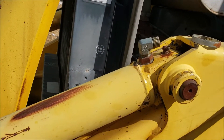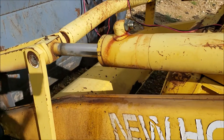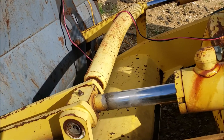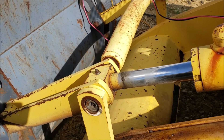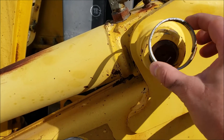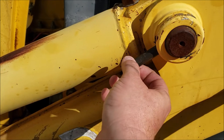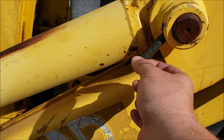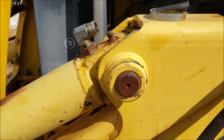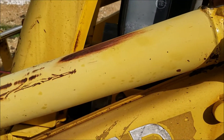Back to the problem — I've pulled those hoses off and I'm actually going to try to replace these seals with the cylinder still on. I don't want to take apart the main part of the cylinder down here — the manual showed me and it doesn't look fun. This part is not too hard. The hardest part is getting this ring right here off. They have a cool design — just rings over the piston, and a little pin slides in, super easy in and out as long as you've been greasing them. Once that pin ring is off, this piston should just slide in and out by tapping it through, freeing up this side of the cylinder so I can take it off.